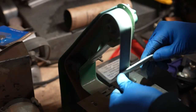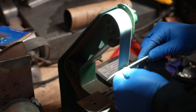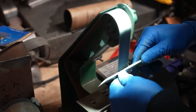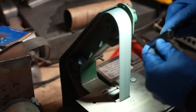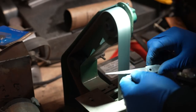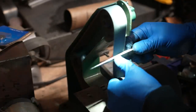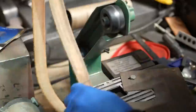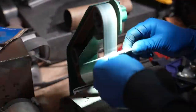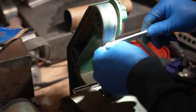Finally I could grind in a sharpening bevel. For this I use a 1x30 with a 600 grit belt, grinding in basically a micro bevel, and then switching over to a leather belt, which is going to give me my sort of final sharpness. I want both halves of these scissors to be super sharp so there's no question they'll be able to cut whatever I put them through. Also, the sharper the pair of scissors, the more delicate material you can cut, and the straighter they're going to cut.